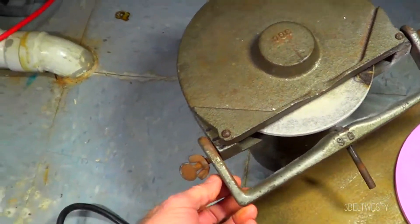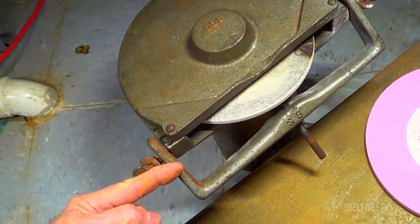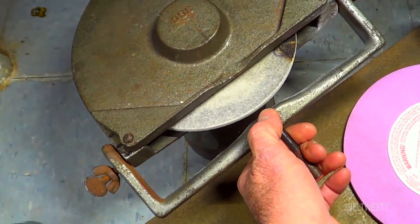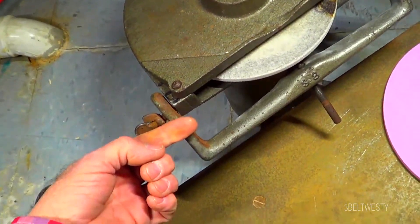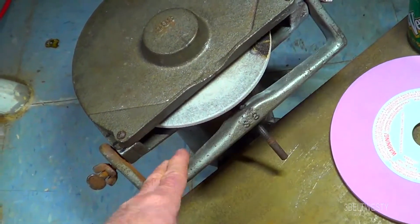So you're kind of stuck unless you modify this and move this leg inboard so you could get it to pivot about a point further in. You're limited because of this piece, so you'd probably have to extend these arms out so that you're pivoting about a point further inboard if you want a modern 1/2-inch radius of hollow.